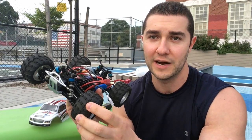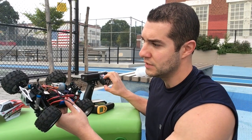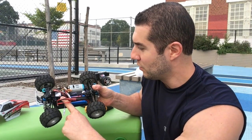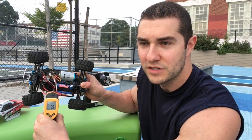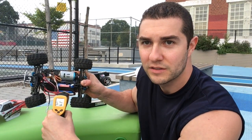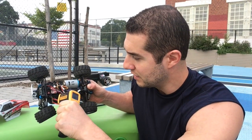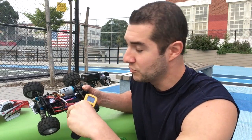Let me turn it on — you guys will see that the front wheels do in fact steer. Okay, so the system is all connected. See that the steering is basically steering itself — I'm not doing that. The servo is being steered by itself and in fact it is getting a little bit hot. I'm not going to keep this connected for a long time. Let's check it with a temp gauge right here. It is going up — right now it is 75 degrees. 79 already. It seems like it's going to be overheating pretty soon. The servo is acting erratically. Up to 83 degrees now.